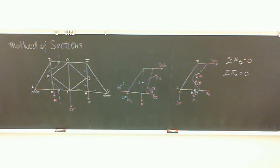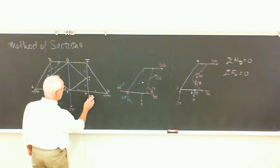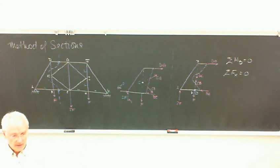Well, this horizontal force is the same as this horizontal force because they're between two pins. But that's not a two-force member across there. I'm just treating it. Oh, Allen magic. You can't do that. I think it's coincidence you got the answer. Captain Coincidence. I suspect if anything changed in this, if this wasn't symmetrically loaded, if one of the forces had a bit of a cant to it, any one of those things would screw that solution.